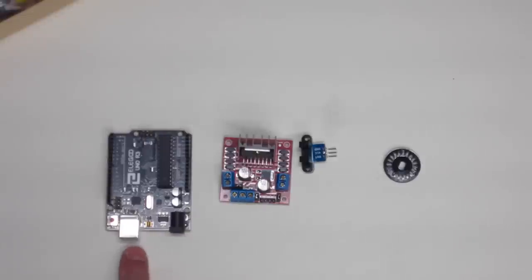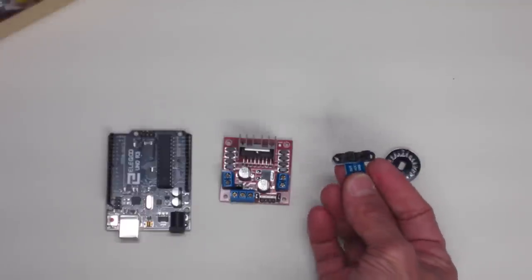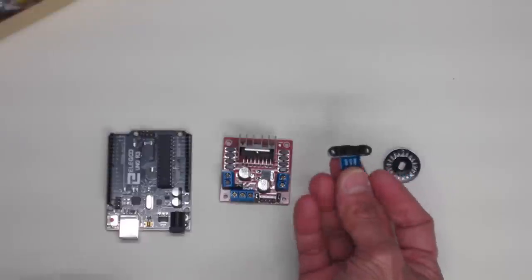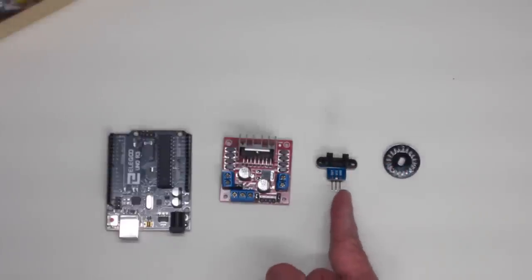The components we're going to add are as follows: an Arduino Uno, which is the microcontroller that's the brains of the project; an L298N motor driver — a dual H-bridge controller that will drive the two DC motors; and an optical sensor meant to be used with the encoder wheel I just showed you, in order to measure rotation. So there's a lot to do today — let's get ready and build ourselves a little robot car.